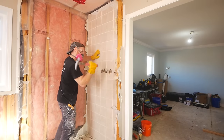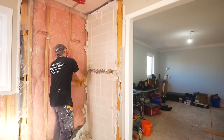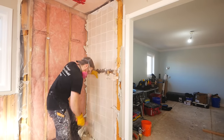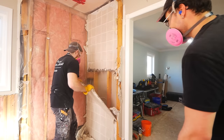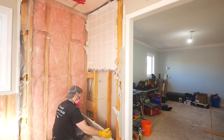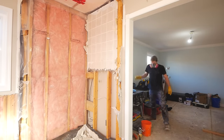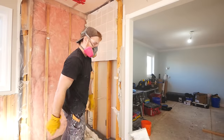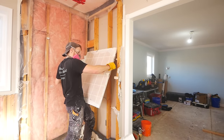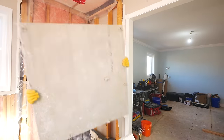For removing tiled walls, I like to just take a hammer and smash a nice horizontal line all the way through the tile and the backer. And then once I have that, you want your gloves on and you can just rock both the tile and the backer board out of the fasteners — just rock it a lot back and forth and it will eventually shake loose from those fasteners and you can get it out in nice big chunks, which makes it a whole lot cleaner and easier. Not all construction is equal. You may have a harder time at this if it was built better, but with the right amount of shaking and elbow grease, it will come out.